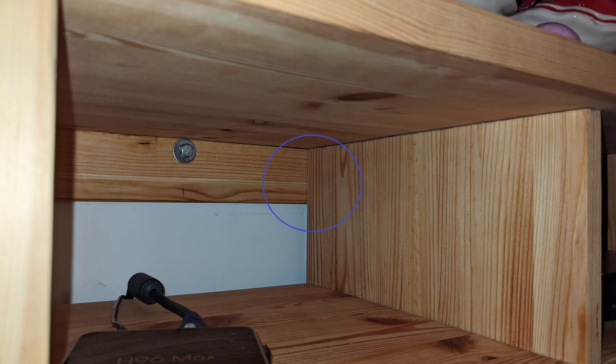The other thing I want to mention quick is for supporting it. You can see here in this picture the backboard that I put in — that is what's supporting it off the wall. That is set inside so the top piece is almost resting on it, even though it's not screwed to it. The top piece is screwed to the sides. What I did was screw two screws onto the vertical supports on each of them in the middle. I had a bit of fear about whether that was enough, but it was more than enough. The total weight isn't too bad, so it was more than enough to keep it all firm — there's no wiggle in it at all.